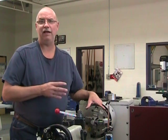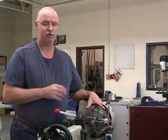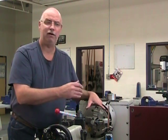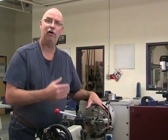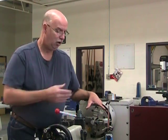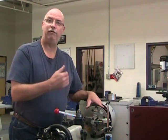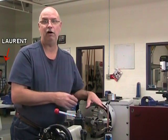We've taken time to center the part by eye as well as possible, so we're pretty close to being centered. You don't need to bring your dial indicator up into the part by three turns of the dial — just bring it up to the part and brush it by about ten thousandths of an inch, or about ten lines. That way you won't get confused about which turn of the dial you're on; you're always at the very start of the dial.